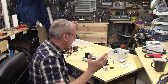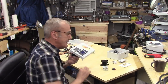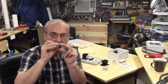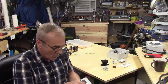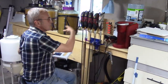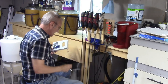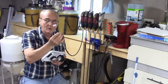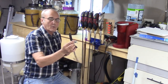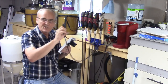Now I need to find a place to put my switch. What I did was cut out a form that my switch just fits in. I'll trace that outline on the box cover, then take it over to the Dremel tools and cut it out. I've got my Dremel tools mounted here with different attachments - I've got one foot pedal which makes it really useful. I'll use the small circular saw first to remove most of the material, then use the routing attachment to clean it out.